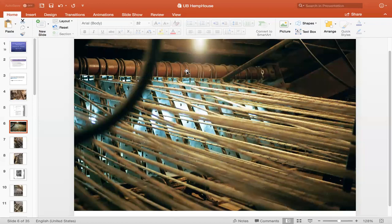Yeah. You know, I've only seen a head block in a hemp house fail once. And literally what happened was the top lag bolt pulled out of the brace that it had. But it had a 2,000-pound piece of scenery hang on it. And we had four head blocks stacked side by side because we had a lot of pieces of line lifting. And it just ripped right out.